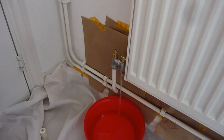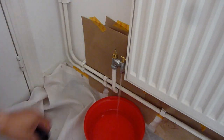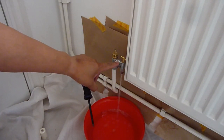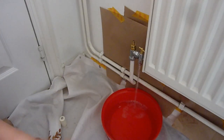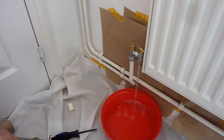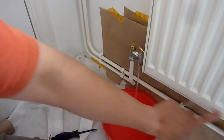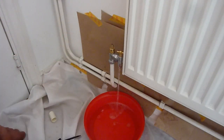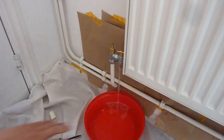When you turn a bottle upside down and the spout is narrow, nothing comes out — same principle. That's clear water coming out, which is unusual. I'm expecting black gunk but don't be fooled. I will undo this nut here and the other nut, and when I take this radiator out I'm going to put my thumbs over the ends, take it outside to the garden, and use fresh water to flush it through. I'm expecting black iron oxide at the bottom. Remember, do not let that stuff get onto your carpet.